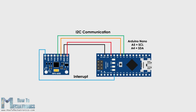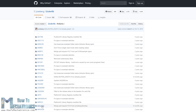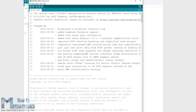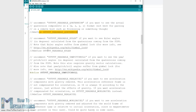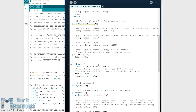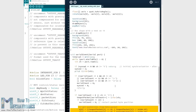First, we need to connect an additional wire to an Arduino digital pin — an interrupt pin which is used for reading this type of data from the MPU6050 sensor. The code is also more complicated, so we are going to use the I2Cdevlib library by Jeff Rowberg. This library can be downloaded from GitHub and a link is included in the website article. Once we install the library, we can open the MPU6050_DMP6 example from the library. This example is well explained with comments for each line. We can select the kind of output we want: quaternions, Euler angles, yaw/pitch/roll, acceleration values, or quaternions for 3D visualization. This library also includes a Processing sketch for the 3D visualization example. Using the serial event function we receive the quaternions coming from the Arduino and in the main draw loop we use them to rotate the 3D object.